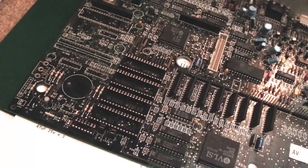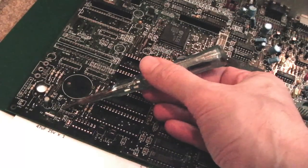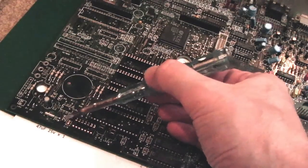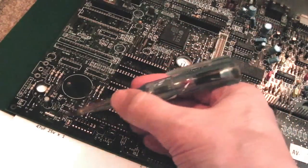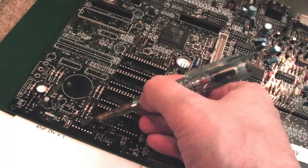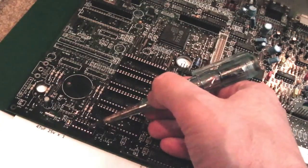So a quick update: there's barely any sun at this time of year, I cannot see anything, it's limiting my work here to about 4 hours a day at the moment, because even with the lights on, believe it or not, the lights are on in here, and I just can't see very well. So you can see we're waiting for an 8-pin DIP socket here. We've got some fixed wires on some of the things on the top side here. It's because there's nowhere to route on the underside. Technically, like that cap there, the pad was missing to its VCC pin and its ground pin. So I could have mounted it on the underside of the board between the ground and VCC contacts there. That's one way you could do that.